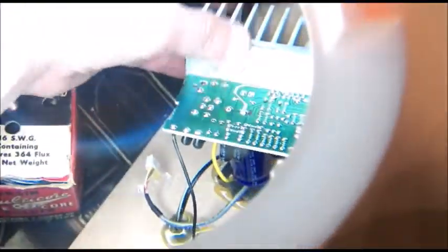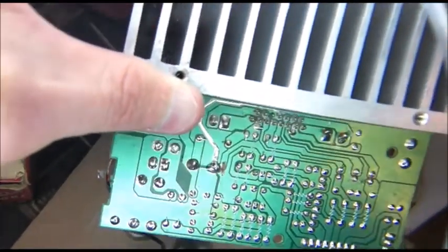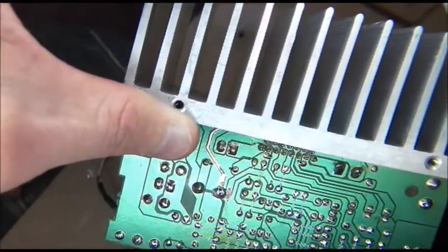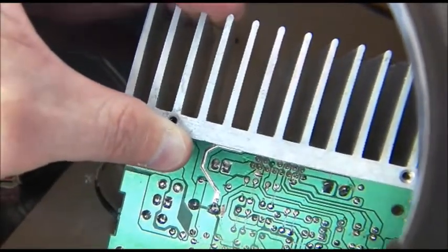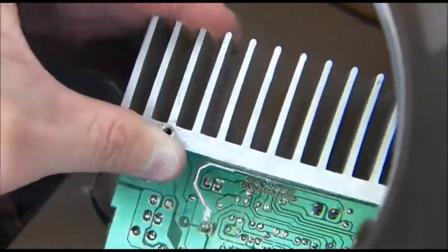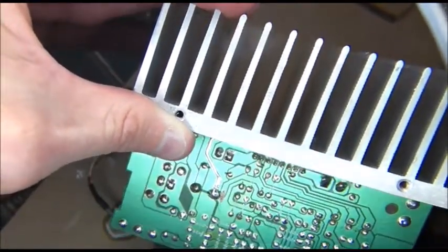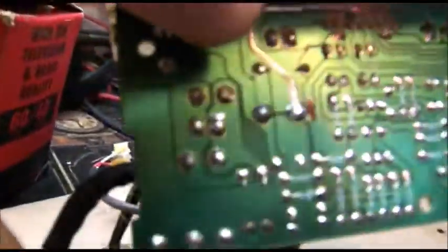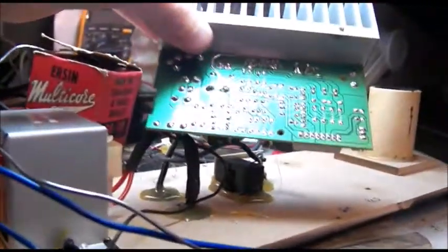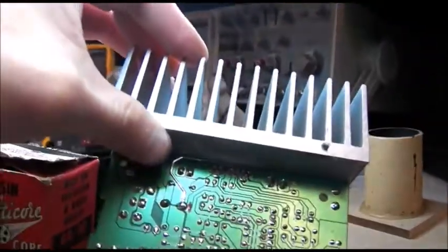While I'm in here, I found another problem. There are some extremely bad solder joints on the power diodes. Right where my thumb is, you can see what looks to be completely hollow solder joints — you would think that's actually where the filter capacitor was just taken out. But in fact, I'm trying to get a good shot of that on the camera so you can see right where that thumb area is — it is, in fact, where the power diodes are. So I'll have to fix those connections too. I'll just pull the diodes all the way out, shine them up, and put them back in.